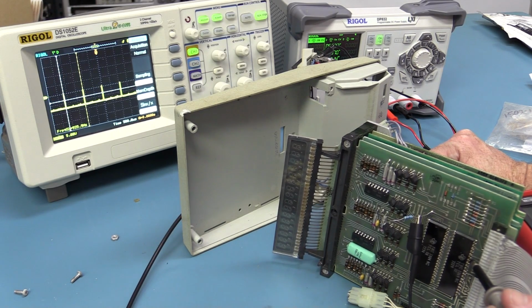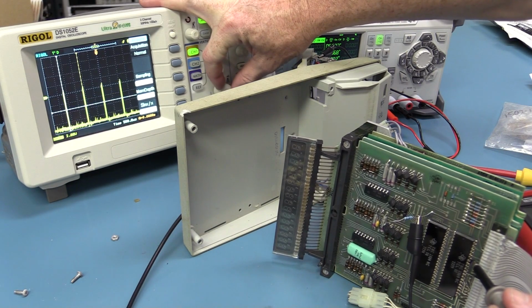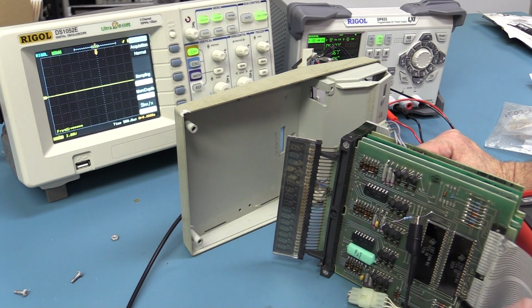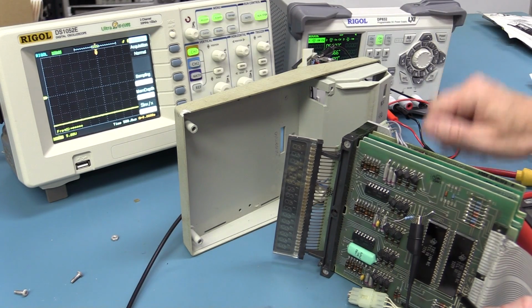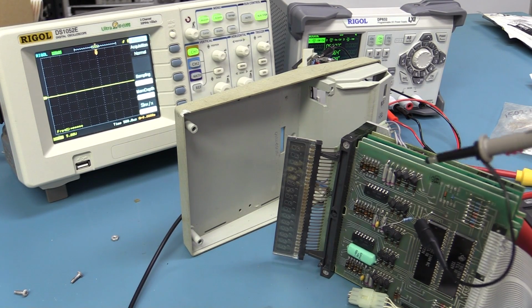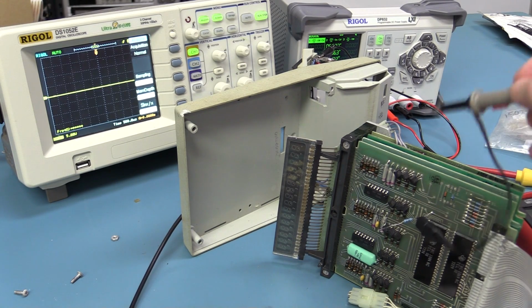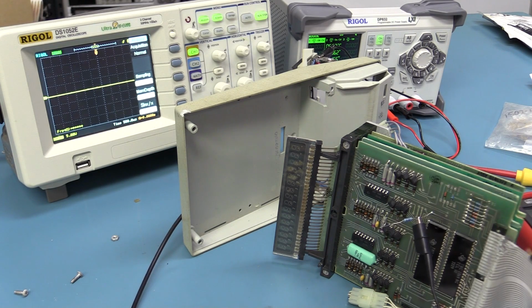So that's a win. That's 925 hertz there. That's 5 volts, 2 volts per division. That's going negative, by the way. So there's lots of negative going stuff happening in here, and that's 10 volts, 5 volts per division, 5, 10, 15, so like negative 15 volts and stuff like that. So yeah, there's data getting in here, and I checked a few supplies on the other supply rail, and yeah, we're getting like a negative 15 supply, and there was a plus 9 somewhere, and other stuff.